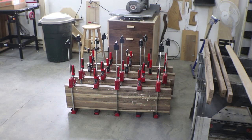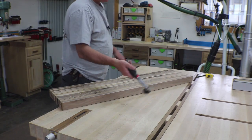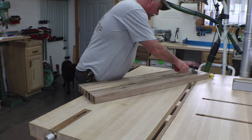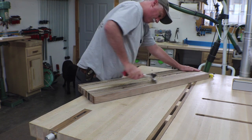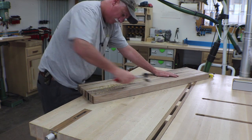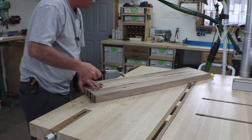There are all four mini slabs put together. I'll give those probably the rest of the day in clamps, then get them out and start pushing them through the planer to get everything flat. Getting them out of clamps now, using a regular paint scraper to get the dried glue off — the planer is going to take any of those marks off anyway.